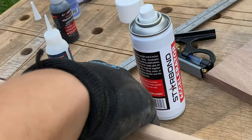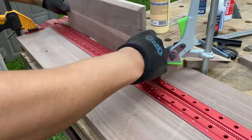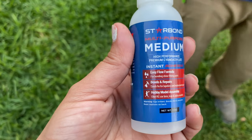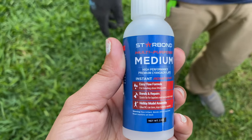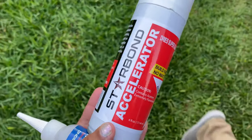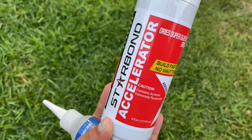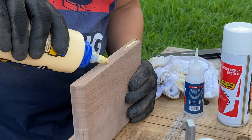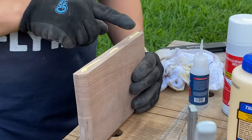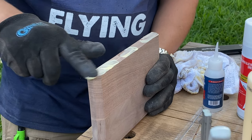Keep in mind that the super glue dries extremely fast — we messed up once and had to take it off, sand it down, and redo it. The glue we use is Star Bond medium, and when they say instant glue they mean it — it's about 8 seconds. Without the activator spray it's around 30 seconds; with the spray it's even faster. We tested it and it was true.